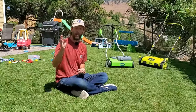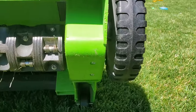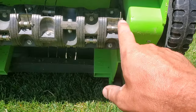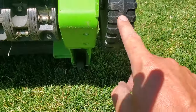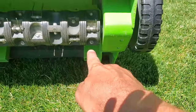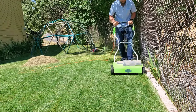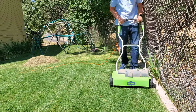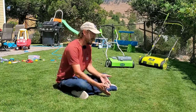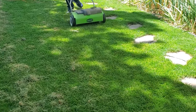Because of the nature of these machines, you've got a wheel, then a little space, and then your first tine. That means you've got about four inches of space that are never being scratched by whatever tine you have installed. So if you're going up along the edge of a sidewalk, the first four inches or so are never going to get hit. If you have stepping stones in your lawn or some other obstacle, you can't go over the top of it.